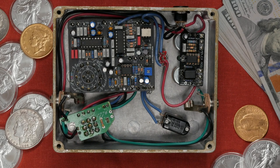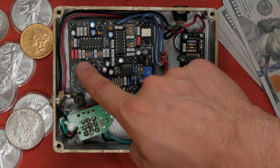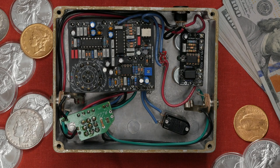The MultiPlex uses a plastic construction 4P3T. Despite being made of plastic, it has a nice torque. It's a non-shorting switch. Non-shorting switches are often referred to as break before make. The connection the switch is making is temporarily broken between positions. 4P3T means it has four poles and three throws. Poles are the number of circuits the switch can control. Throws are the amount of contact points.